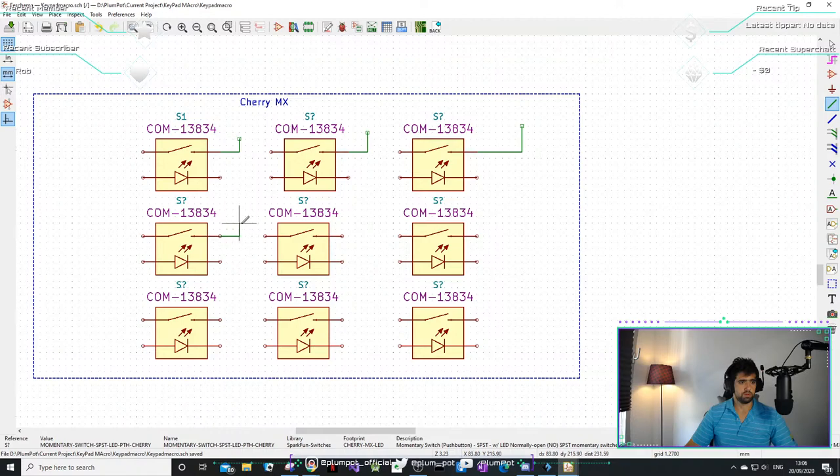Just gonna put these buttons. For the startup, do you guys make a PCB or did you just get some dev boards and put it together to test it? What are you currently playing if you have time, Magpie? Guys, I'm just making the buttons for Cherry, so hello, 3 volts, yeah, and then it pulls high when I push the button. Well, generate a high signal, should I say.